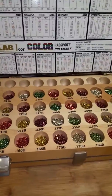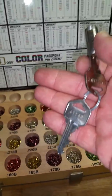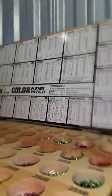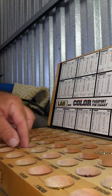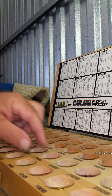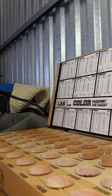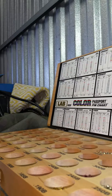As you can see right now, what we have here is a Lab 005 pin kit. We have our plug and we have a set of pre-cut keys. So now what we're going to do is we're going to make those pins fit this lock. We're going to take the first pin and try to see what we can do here. I'll put 235 in there — there's the first pin right there. That one's just a little bit low, so we've got to go up to the next one.